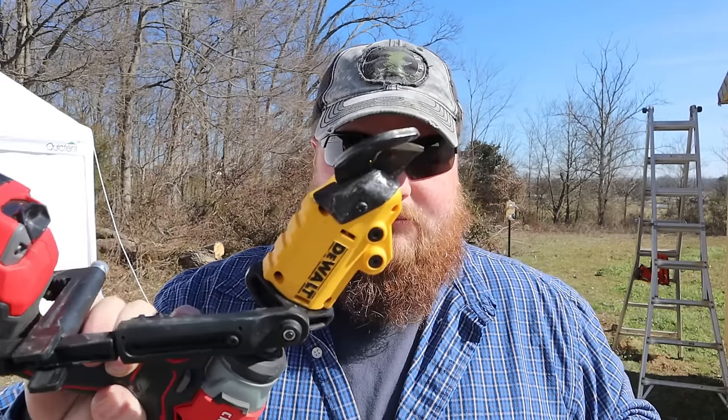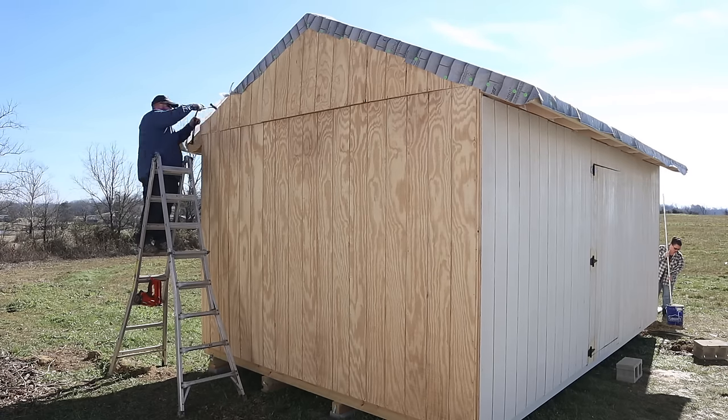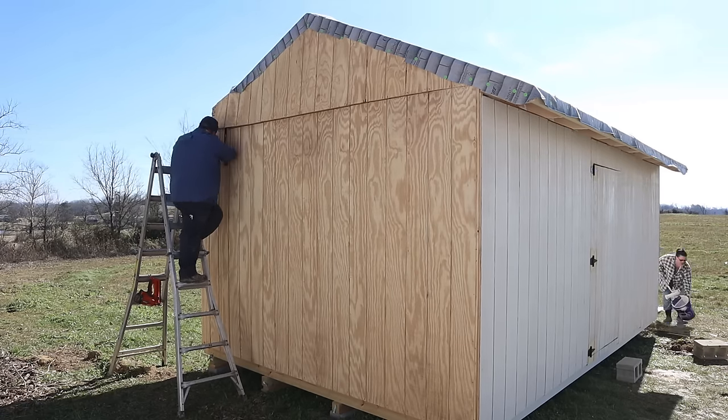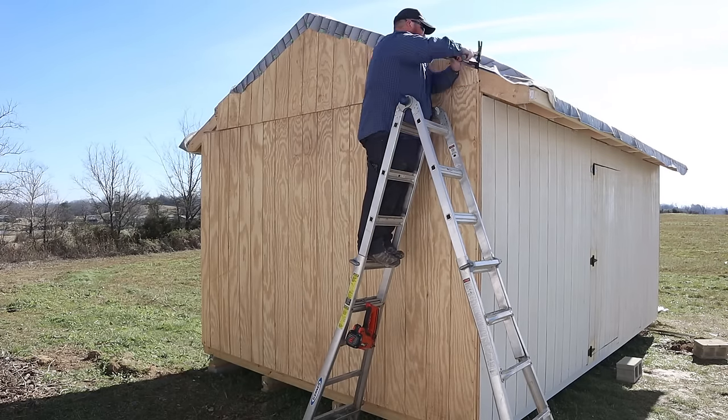Not too bad — this tool is really great for metal roofing and also pretty good for trim. I've got this side of the workshop siding pried off and I have the Z-flashing started. If you'll notice, I had some blowout on that corner down there. I could take that whole piece down and recut it all new, but I've got some weatherproof outdoor wood glue. I know when I glue that back together it's going to be just as strong, if not stronger, than a replacement piece. I'm not worried about any water getting in. So the next step is shimmying the Z-flashing into place.